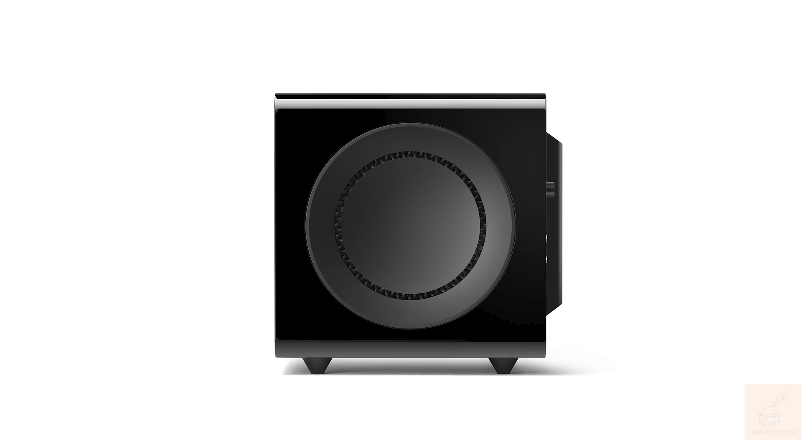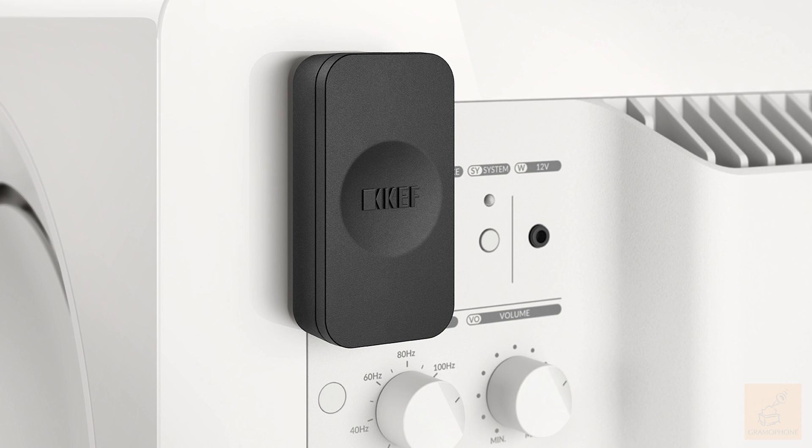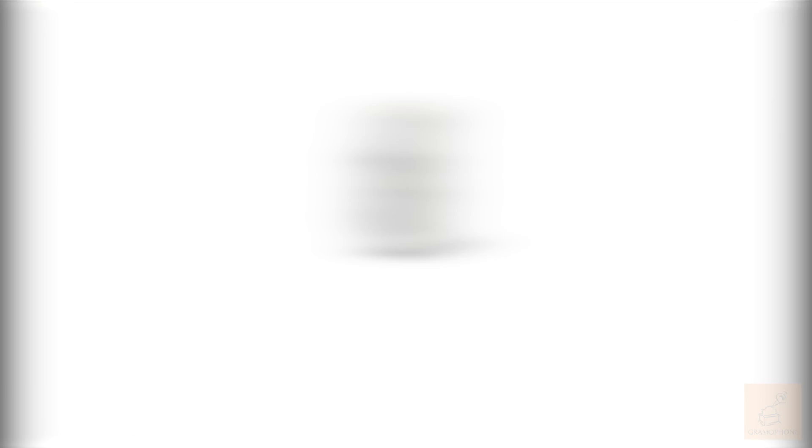The third thing, obviously, is a second KC-92 so you can stack it on top — or even a third. The benefit to the consumer: you're going to actually get 6 dB more output, which means you can turn both subs down a little bit and pick up more headroom. So you're not just getting more bass, it's more low-distortion bass. The subs aren't working as hard. With two subs you get 6 dB, with three you get 9.5 dB — and you didn't give up a single additional inch of floor space.